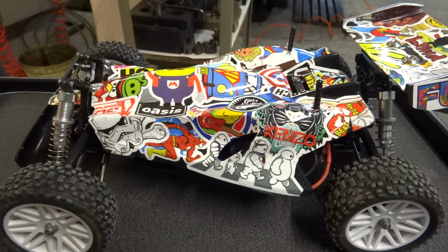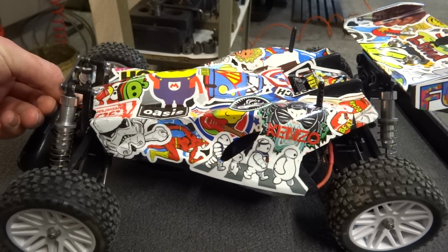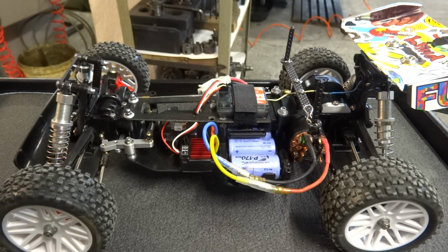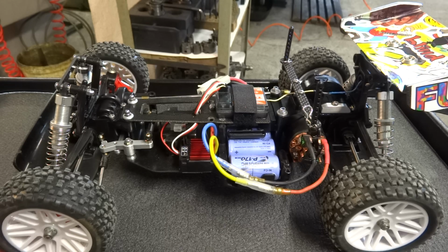As I said, after watching Kevin Talbot's video of rebuilding his old Tamiya, I got hooked again to make my car running again. As we all know, the TA01, TA02 and DF01 chassis had major problems with strength in the front A parts and back B parts. So I decided to make a lot of upgrades and modify these parts to make that car a lot stronger, and even have no problems to run brushless motors on that car.